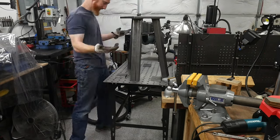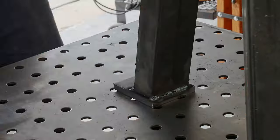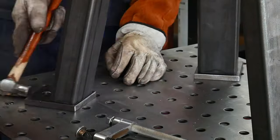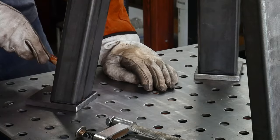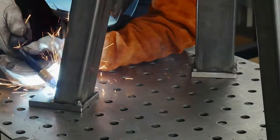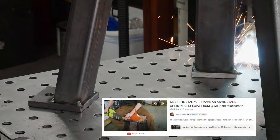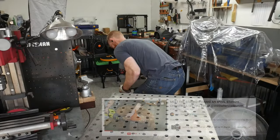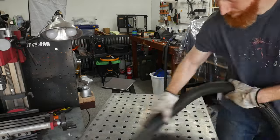This did allow me to flip the stand while keeping the sand in the legs. However, it's probably not the ideal method, since the burning of the JB Weld during welding caused some issues. If doing this again, I would probably do what Alex Steele did and just drill additional holes in the base plate to fill the legs from the top after the stand is fully constructed.